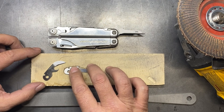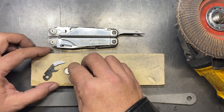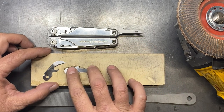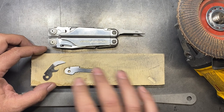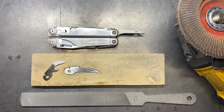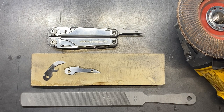I started out by taking the tool and using a 2x4 and a hammer, I just made an indentation into this scrap piece of plywood. The reason I did that is because now I can work on it hands-free — I could set it in there and the plywood would actually catch it. I started out grinding it first with really light passes, a couple passes at a time, checking it multiple different times. I made sure that I used a flat disc that was really worn down because I didn't want it grabbing or biting in too much at a time.